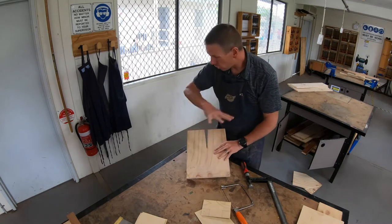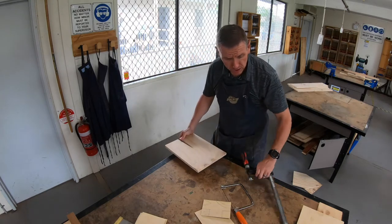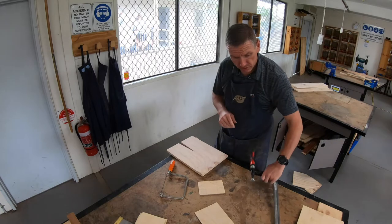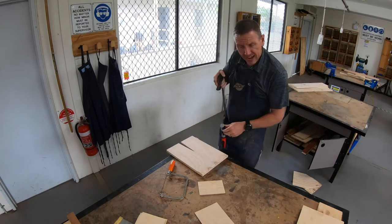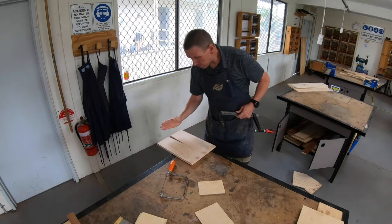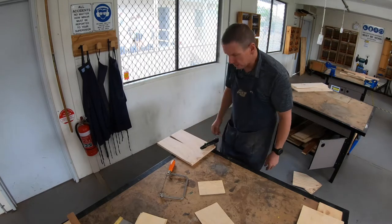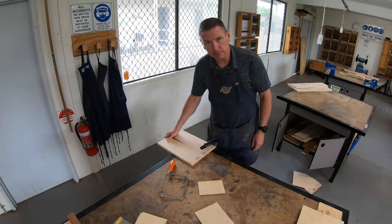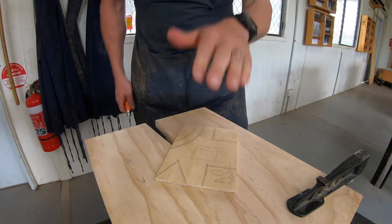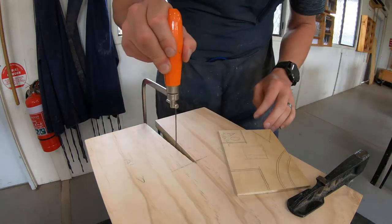I've got you up nice and tall there just to show you what I'm going to be doing and how to set up your v-board or your notch board. I'm going to show you how to set this up using a clamp so that it's easier for you to use your coping saw to cut out your pieces. First thing, you need a clamp. Make sure that you put the handle downwards — if you have it up like that, there's more chance of getting in the way or bumping yourself on it. Having your notch right over the edge of the bench, then closing up your F-clamp and tightening that off nice and tight so that the board isn't going to go anywhere. Now our v-board is nice and safe and firm, and I'm ready to start cutting for our add-ons. Just make sure the V is in there so our blade can go in there.